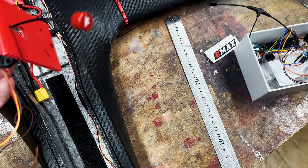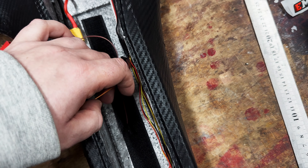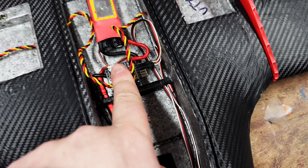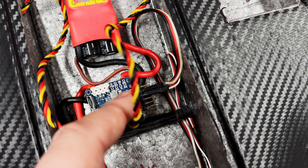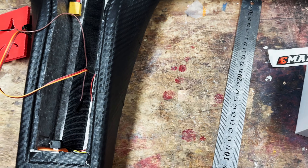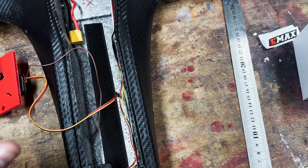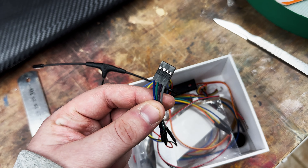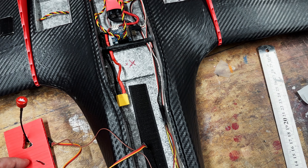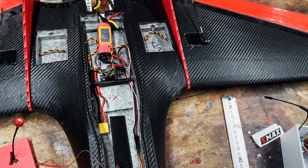The smart audio cable, if you didn't see the video where I wired this up, is separate to this because on this board they are separate - that's what that little red extra pin is for. On the bigger board, the F405 WSE, that's the F411, using the older stuff because it's what I had in stock - they're out of stock now. I believe the pins are all next to each other so I can have one of those big four-pin connectors again. They should be linked in the description. Let's get this stuck down and make sure I haven't made a complete mess of things.